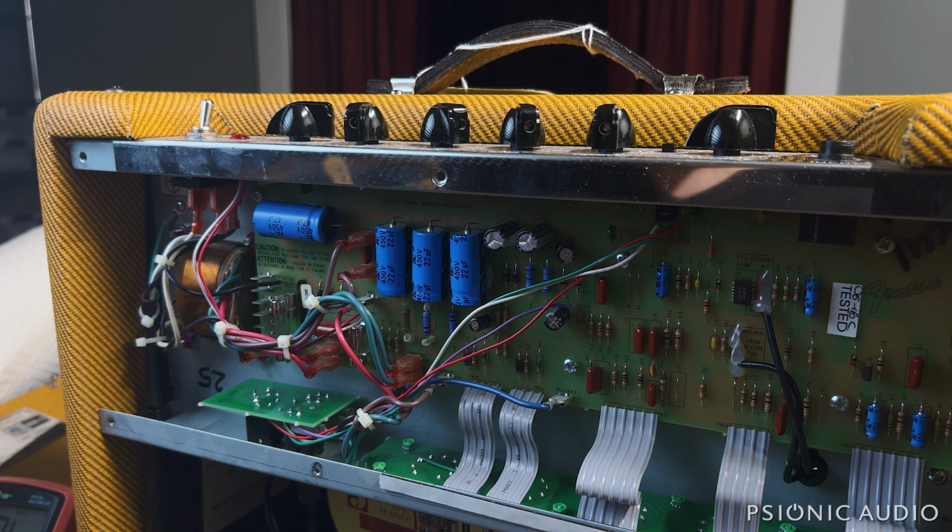And again, it will prolong tube life if I give it a real input jack and upgrade the screen grids to some 2 watt 1Ks and cool the bias down to a very sane 55-60% idle dissipation as opposed to the 110% that comes from the factory. His output tubes will last a lot longer and the amp will sound even more Fendery without doing a bunch of Bill M mods and cramming a bunch of orange drops in everywhere.